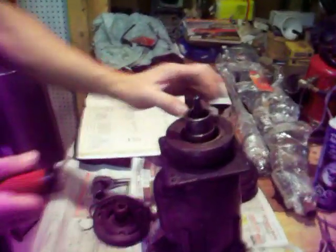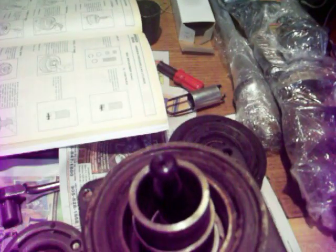We've already put the new O-ring that seals on the outer part inside — it's approximately two and a half inches down into the nose of the compressor — and we're ready to put the new seal on. That's the seal that seals upon the shaft that spins around.